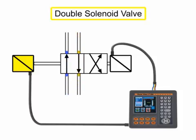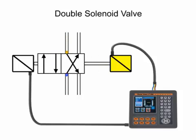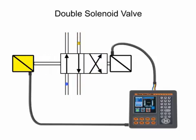Double solenoid valves have two solenoids, typically mounted on opposite ends of the valve body. This type of two-position double solenoid valve does not have a spring return. When the first solenoid is energized, the valve spool shifts into the first position. Even if the first solenoid is de-energized, the spool remains shifted, because there is no spring to return the spool to its original position. Energizing the second solenoid will send the valve to the second position. Even if the second solenoid is de-energized, the valve will remain shifted until the first solenoid is re-energized. Since there is nothing holding the valve in the shifted position other than friction, these types of valves should be mounted horizontally to avoid self-shift due to excessive air flow or vibration.